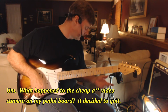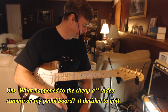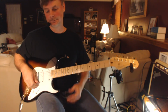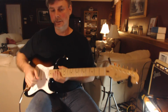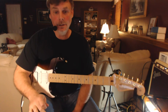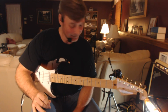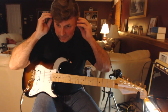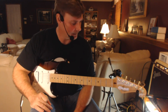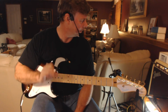It's a killer amp, but I'm big into using overdrive pedals through the clean channel of my amps. But as an alternate overdrive sound, the overdrive channel sounds really good in this amp. So there you go. There you have it. It was a long-winded review. But yeah, if you have a Fender Supersonic 22 combo, I highly recommend carefully, very carefully clipping that bright cap in the clean channel.